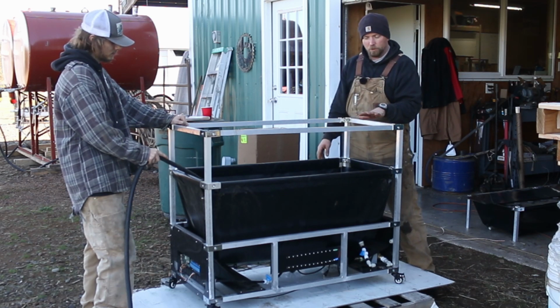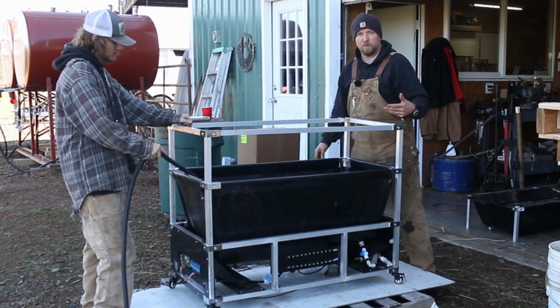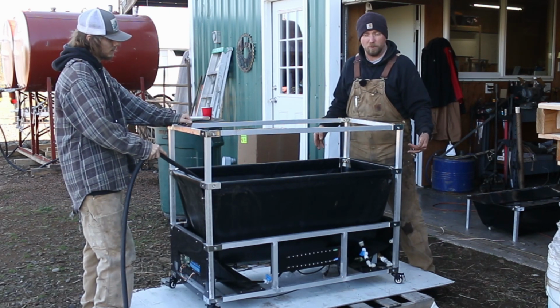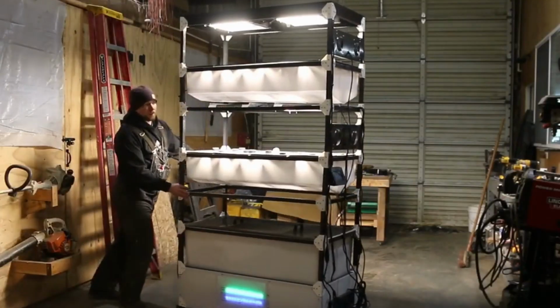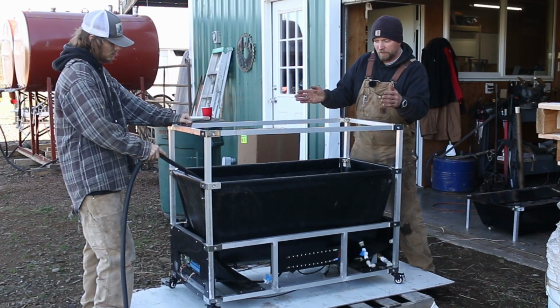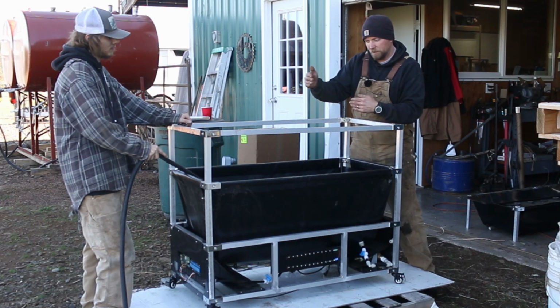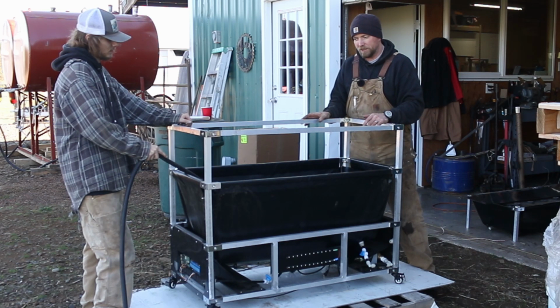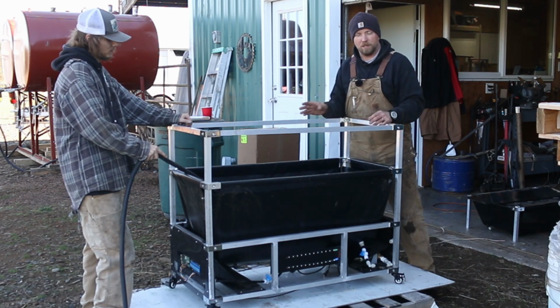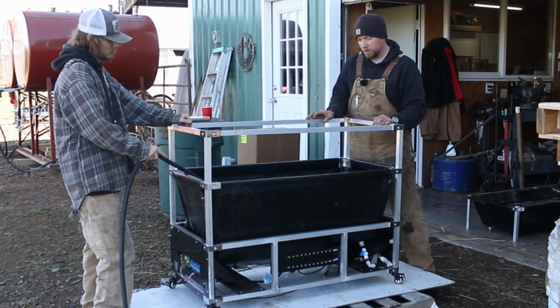And we're actually also removing one of the wheels. We used to have 3 wheels on the base, and we've removed that mid-span one because the loads just don't go there anymore. On the old plastic ones, we used to have vertical members at the mid-span. So now the only thing we'll really see is probably the aluminum pulling in this way just a little bit, and then also down a little bit. As long as it's less than 1/4 of an inch, really about 1/8 inch, 1/16 is what we want to see, then we're totally fine.